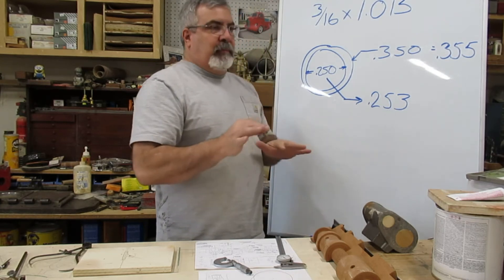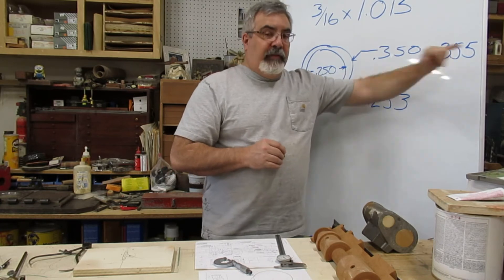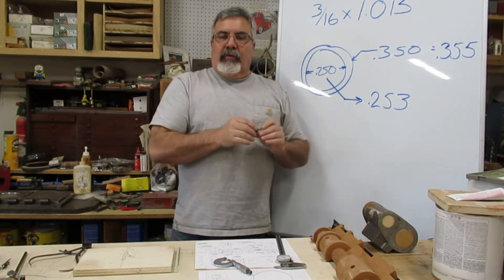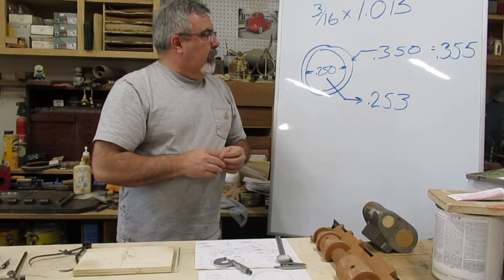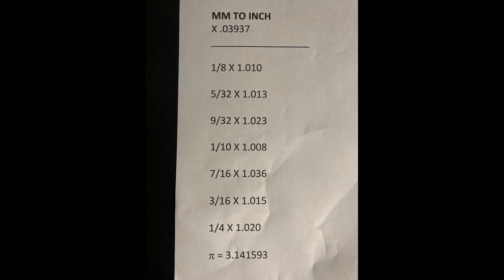When you're first starting out, use the calipers with the locking nut — they won't spring open. The spring calipers can come flying out and hit you if they grab; I've had that happen once in fifty-something years. I'm going to use a parting tool to put a groove in while holding the calipers against it. Do not do this if you don't feel comfortable. I'll rest my arm up here so if the calipers get stuck they just flop rather than fly.